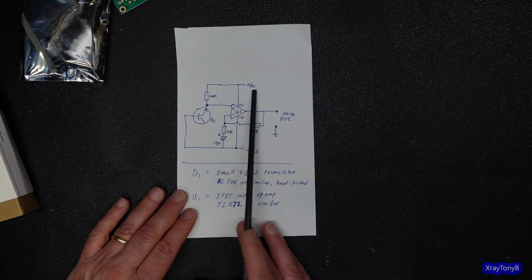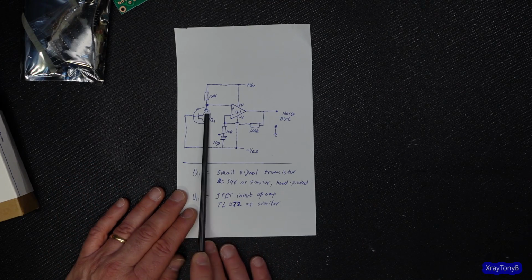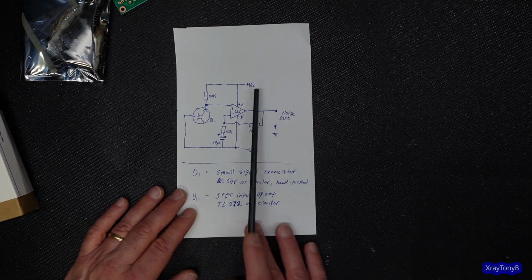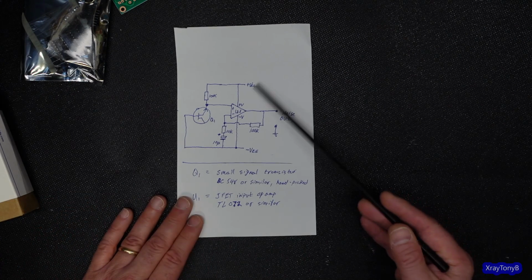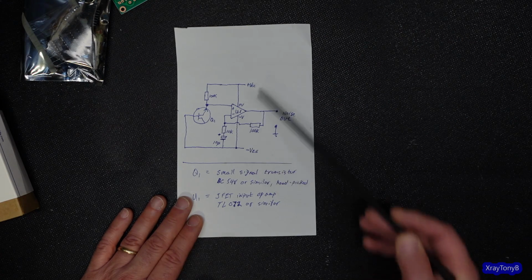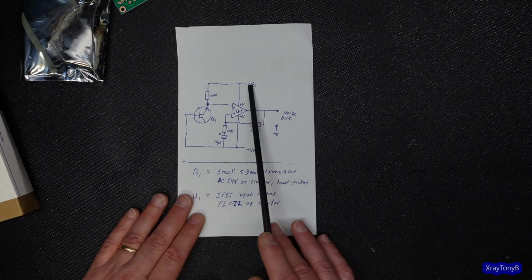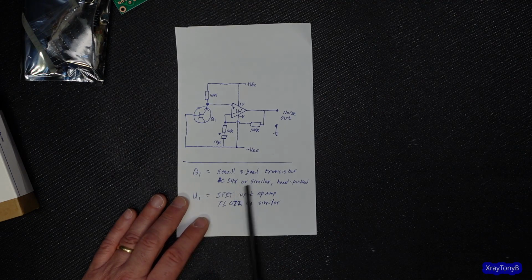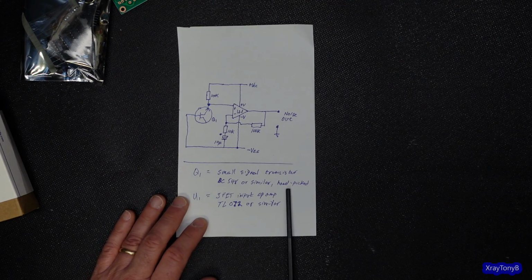And all we're doing is we're kind of current limiting it so we can't overdrive this. And you're just taking a voltage, and it can be plus and minus 12, plus and minus 9, anywhere. You have to experiment with the voltage. And you can see I made a note. You really have to hand pick the transistor.